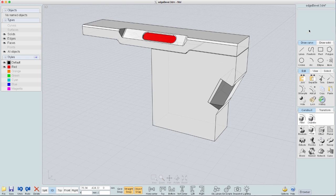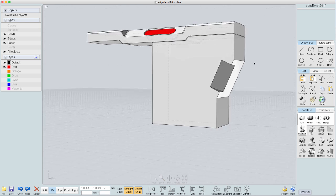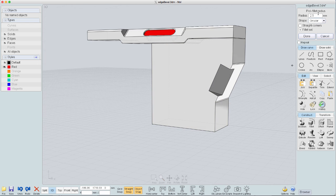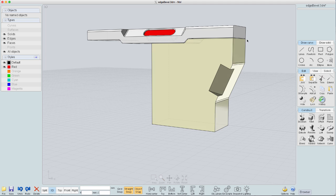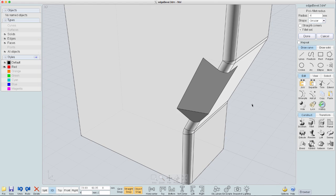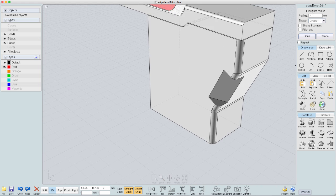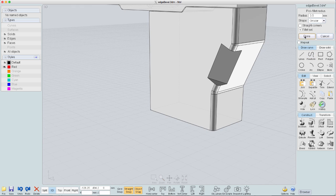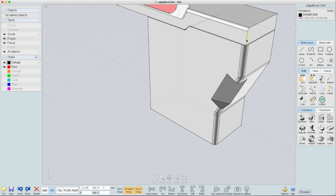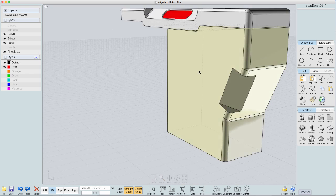I'm using 12 for the chamfer size. Once that's done I'm going to union both of those back together so now I've got that little spot right in there. Once that's done I'll add some fillets around the surface — using maybe 3.5 — and add the same fillets here as well so they're matching.